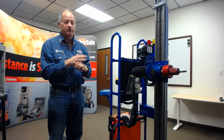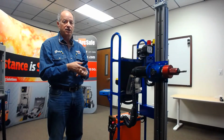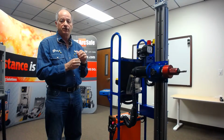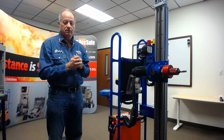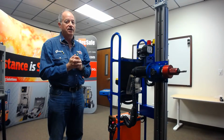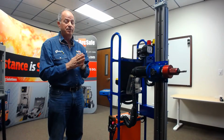And while I'm not a cubicle technician, I can tell you that you've got a 50-year-old lineup of switchgear. You could have a settling foundation. You can have a bent racking mechanism, a dry racking mechanism. You can have grease that's turned into glue, turned into cement on your finger clusters, so they're not spreading. I've seen people put 2 or 3 different types of grease literally on a pair of finger clusters. And my dad taught me all the way back in high school chemistry that if you do this, you're going to generate a chemical reaction and you're going to have rocks back there. And that's what we had happen.